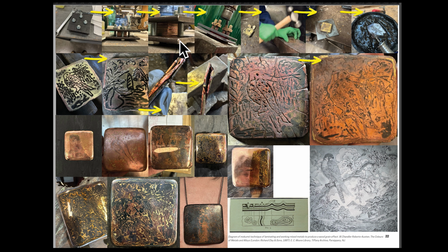I saw it start sweating, and I called a tutor over, and I was like, this is the point where it happens. And in looking away and turning away to the tutor to show him this, I let it get past the sweating point and into the melting point. And that's what caused this brass leak. It's genuinely about 4 or 5 seconds of looking away and not moderating the heat in the way that I should have been. And that's a lesson I've learned, is just complete focus.